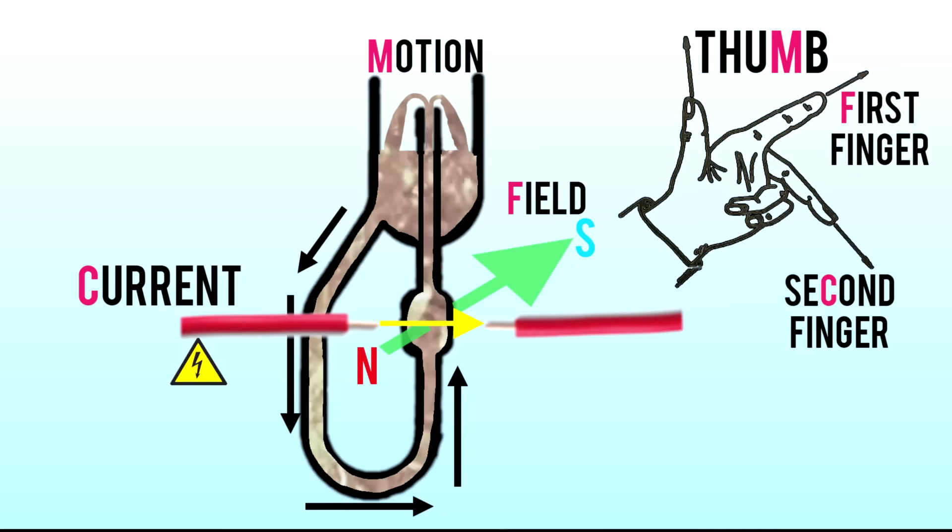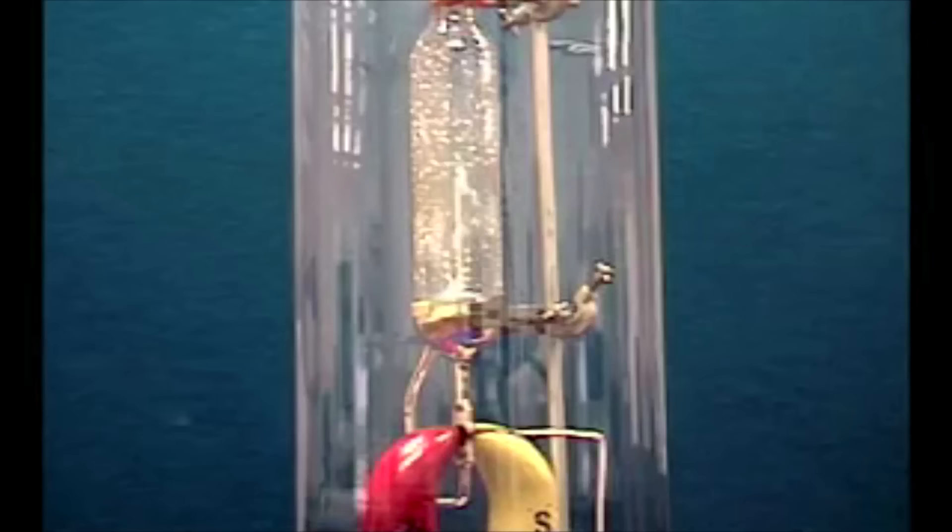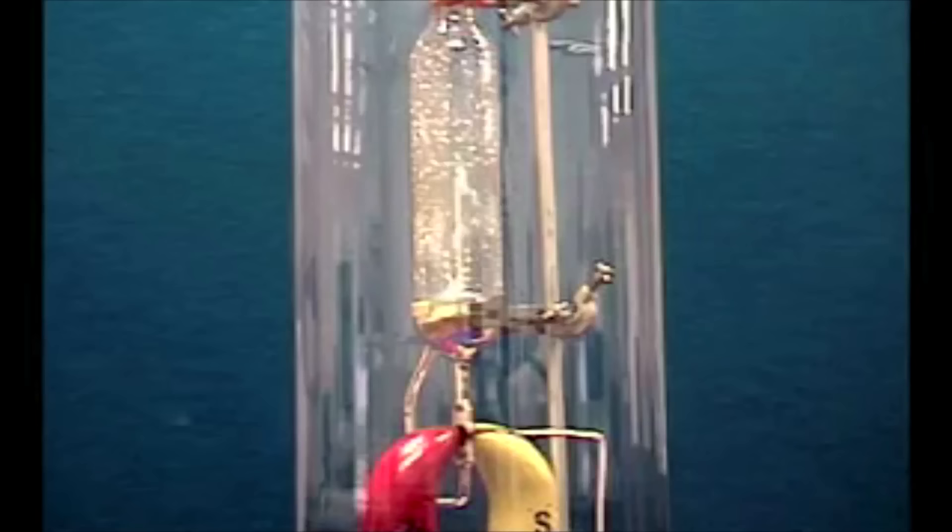Because the material is so dangerous, the whole apparatus is surrounded by a glass bulb containing argon. So if there is a leak, all being well, it doesn't burst into flames. The NaK goes round and round, washing the surface over and over again, and so you could measure the corrosion quite precisely.